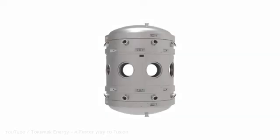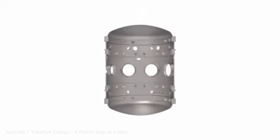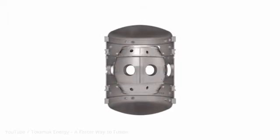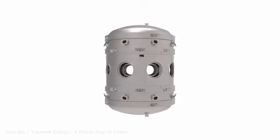Outside these magnetic coils is the outer vacuum chamber. Along with the inner vacuum chamber walls, this forms the cryostat. The cryostat keeps the coils at liquid nitrogen temperatures. The copper conducts much better when it is cold, and so it increases the magnetic field created. So those are all the important components of ST40.